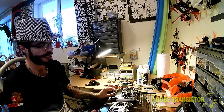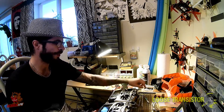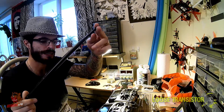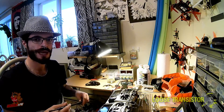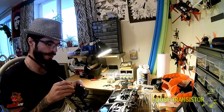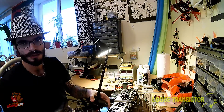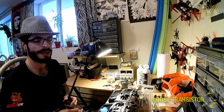Originally what I really wanted to do was a video about modding the antenna transmitter on the AT9 so I could use an external RPSMA pigtail coming out of the top of my radio. That would allow me to run a higher gain antenna, like this crazy 8 dBi 2.4 GHz antenna I got, or use it in a ground station. As winter is approaching here in Canada, I want to fly from inside my car, so I got this TP-Link Wi-Fi range extender — basically a magnetic base with an 8 dBi antenna and RPSMA cable — so I can run it on the roof of my car.